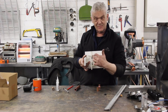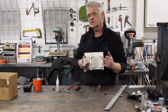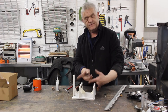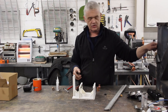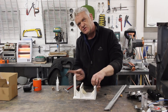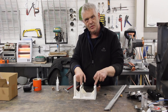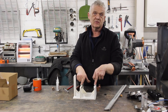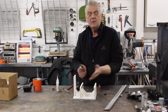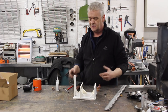You can see the magnets there and there. These are twelve and a half centimeters between center and center. What we need to do is arrange another couple of magnets with the poles pointing in the same direction — pop them there, and what will happen is it will force itself that way but float on the field of those two magnets. They need to be twelve and a half centimeters apart, the same center to center.